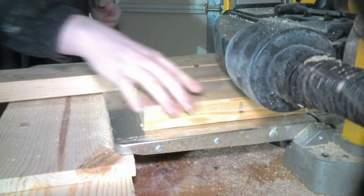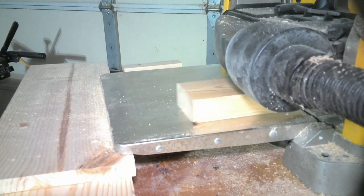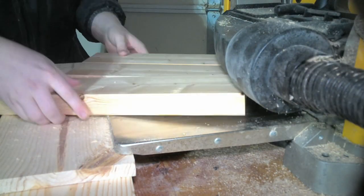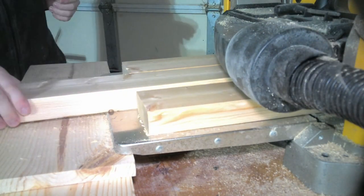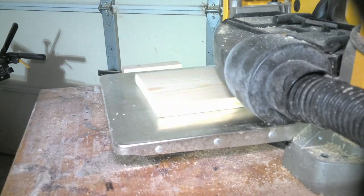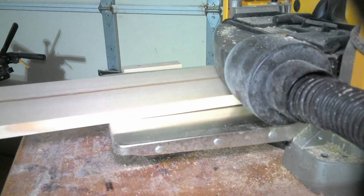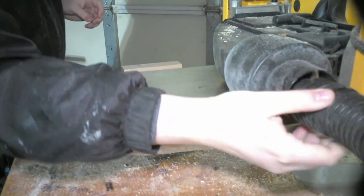As you can see here, we're planing down all our lumber and cuts. Working with dimensional lumber, it's not always going to be perfect. There's going to be flaws — it might be twisted or have a knot in there somewhere. Planing really saves you a lot of hassle in the long run if you can get it done early.